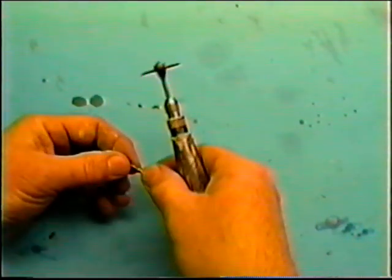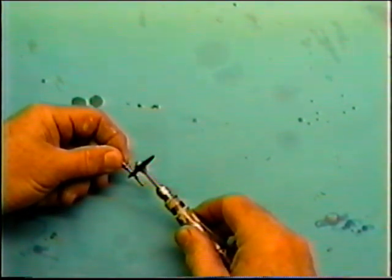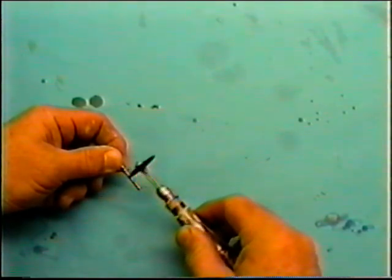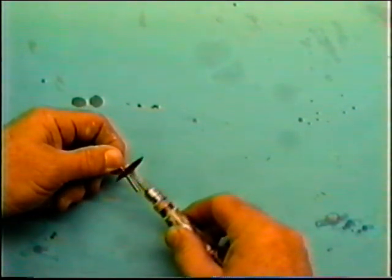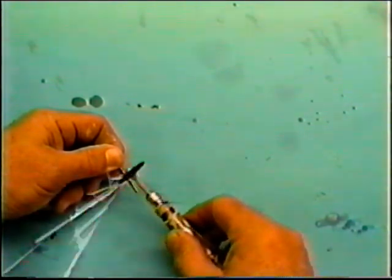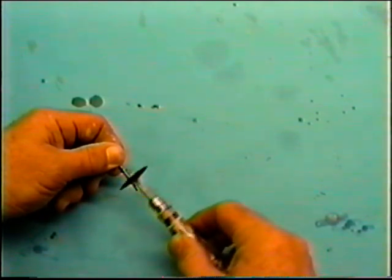And we use the relatively large parting wheel. The idea is just to roughen it up, the same way you would roughen up a bell crank post. No shiny surface. And as much as this may seem like a lot of overkill, if this part pulls out, it's just like folding the wing. By the way, it's interesting to look. Whenever you do this, if you've never cut titanium, you'll see the sparks are white hot.